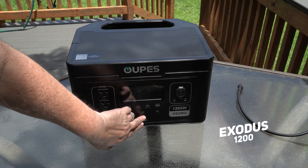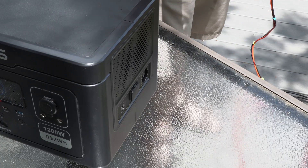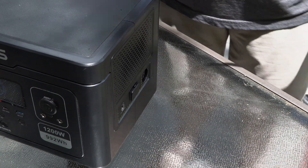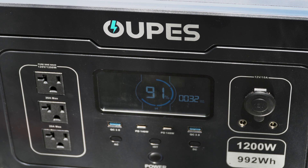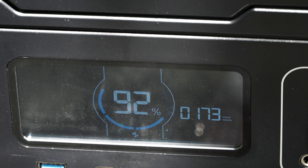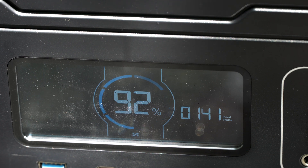The Exodus 1200. Let's get it plugged in. The 1200 can take 240 watts of solar, so I've disconnected one of the panels and extended the MC4s, then converted it into the DC 7909. Since the 1200 can only take 240 watts of input, one panel is the max you can do on that. That one panel has bounced between 160 and 170 watts. I could probably get a little more if I adjusted it, but taking the output of the panel — either the 7909 or extending the MC4s and converting to the 7909 — into the Exodus 1200 works well, and one 240-watt panel will charge it pretty efficiently.